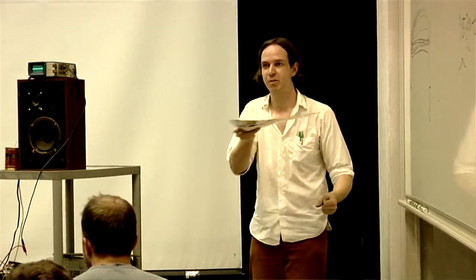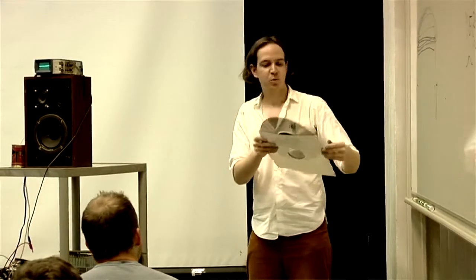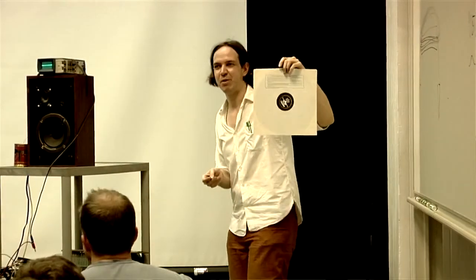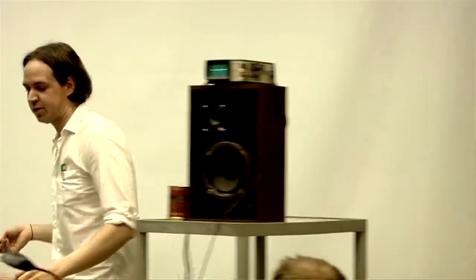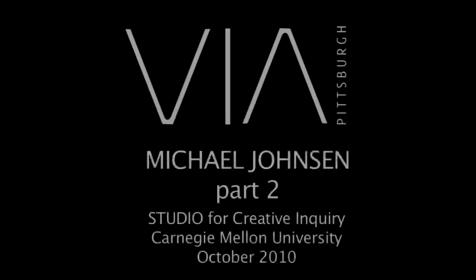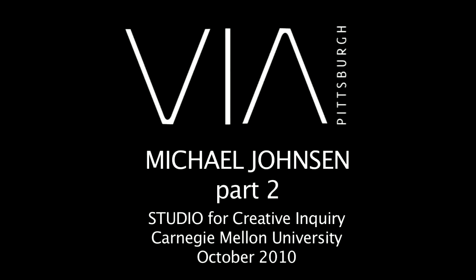That's a kind of simple way to send sound across a room. On the subject of chopping, we can actually encode sound optically onto discs — sounds encoded optically the way a film soundtrack works. We can read them in precisely the same way that we just sent sound across the room — just put a laser beam through it, put a sensor underneath, and we have a kind of primitive sampler. This was a very short-lived toy called the Optigan, made by the Mattel company in the mid-1970s for about three years. The basic idea is that it's an optical soundtrack just like a film soundtrack, which we're still doing optically. These technologies may seem old-fashioned, but none are really out of date — they take advantage of very simple characteristics of materials, and the loudspeaker and microphone aren't going away any time soon.